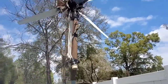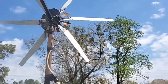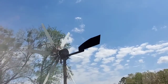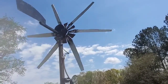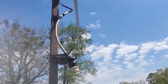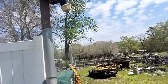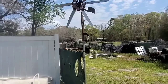I just got a little AC light bulb hookup on here so I can put a light bulb in it, and then at nighttime if the wind blows it puts out a little light. But I'll hook it up with a bridge rectifier — three-phase AC to DC. Right now it's just a three-phase AC motor and it puts out three-phase AC. I'll use a rectifier and get DC voltage out of it and charge batteries. Whenever I get all that done I will get a reading on it for you, and we'll see what we're getting out of it. Thanks for watching.